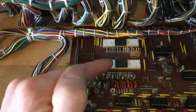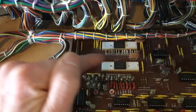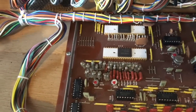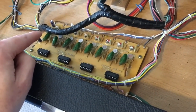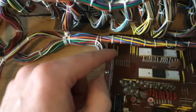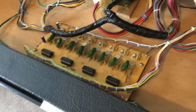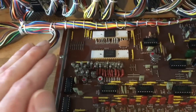The second thing it does is send the note information to the YM267. That note information is then turned into a voltage by this chip - so this is a digital-to-analog converter chip. It uses other things like the tuning pot on the front and the state of the portamento, and then generates the voltage to send into the capacitors of the sample and hold circuit, which the YM266 has just opened and closed depending on which key has been pressed. So the two chips work together to control the sample and hold board - that's their most basic function. After that, this note information also goes somewhere else, and this is where it gets really, really interesting.